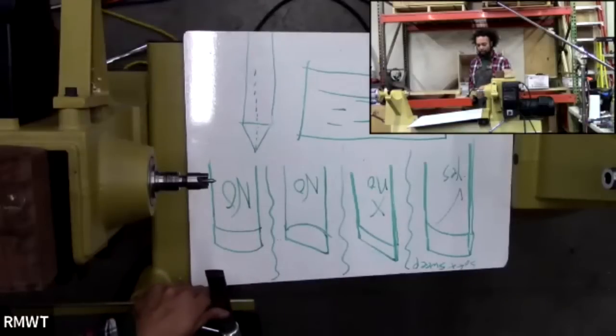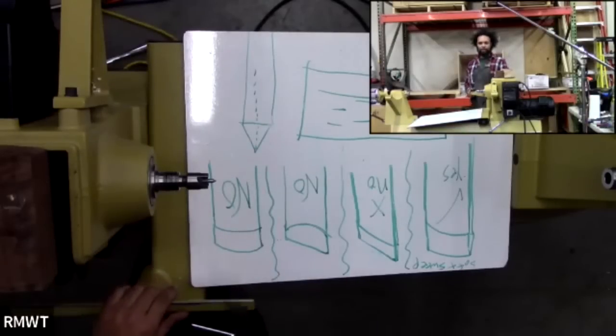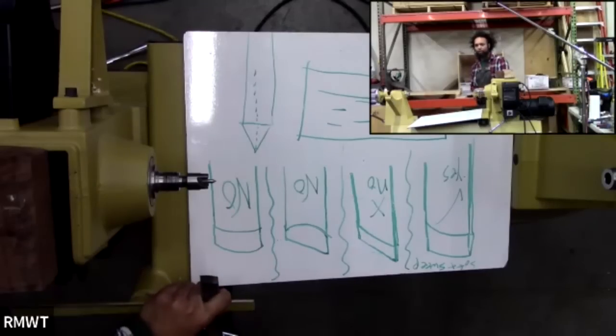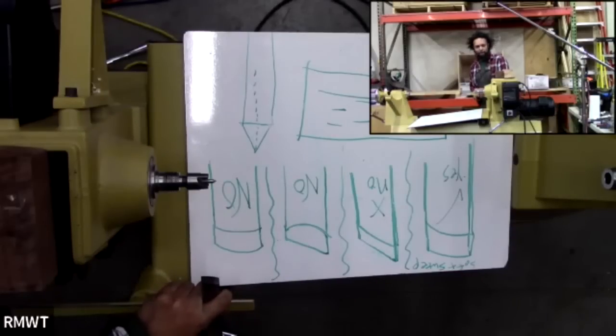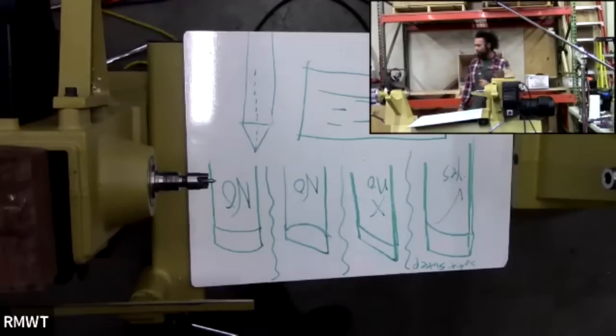As I see it, you're going to lose a burr in less than 20 seconds. On any tool you use, you're not going to have a burr for very long. I have a 20 second rule for a burr or less. Then for tool sharpness, you only have about 5 minutes after that before you really have to go back to the grinder. So as a production turner, this is good: one, two, that's two steps to the grinder and you're set to go.